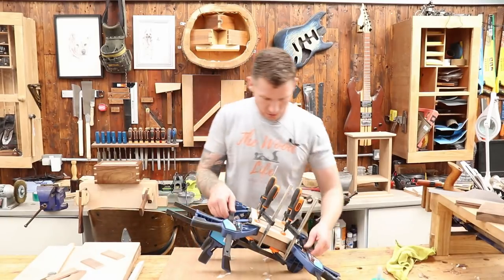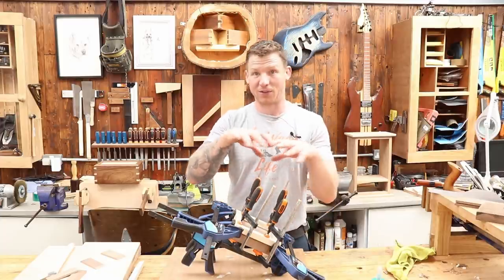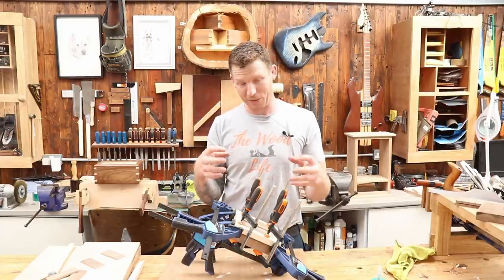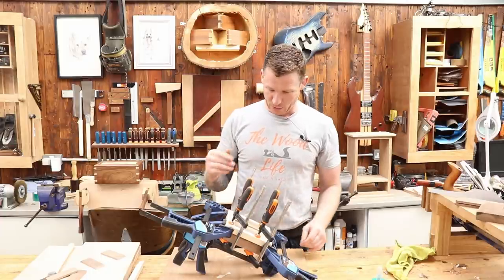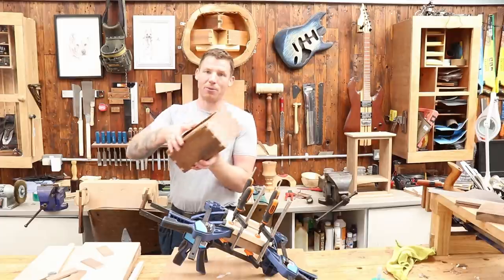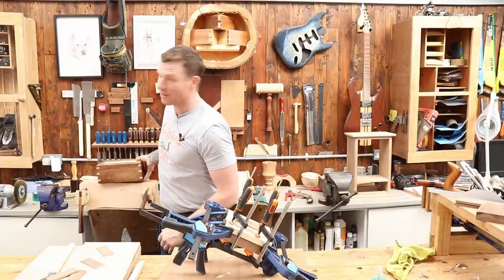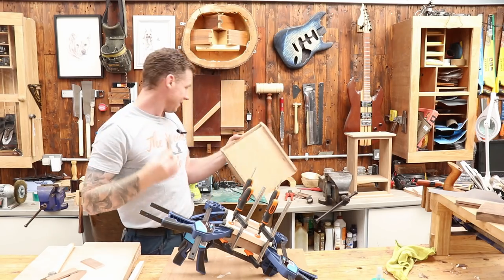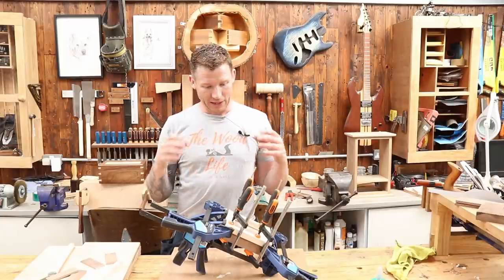The box is just about done. The lid is pretty tight and snug — a good solid airtight fit all around. The inner inserts are installed with glue. It's very square but I feel it's lacking something, so I'm going to chamfer the edges — the line between the lid and the box, and the base — to add a little bit of detail. I have my little block plane and I'll mark a small chamfer around the lid, around the gap between the lid and the box, and around the plinth.